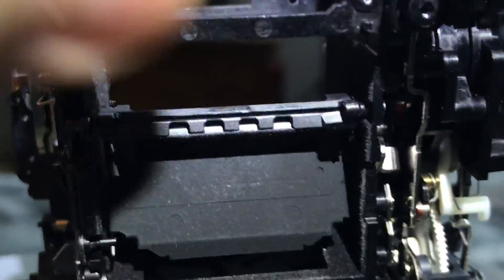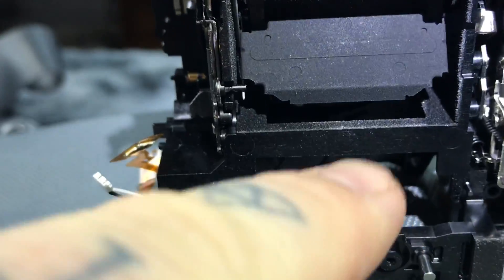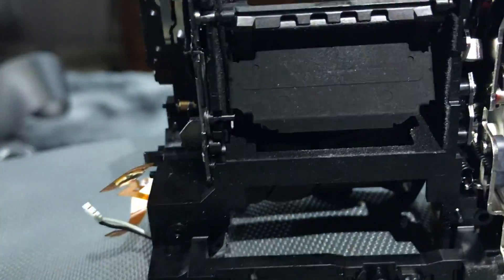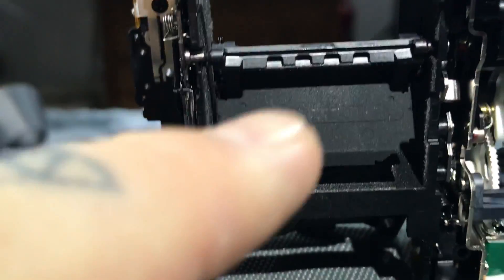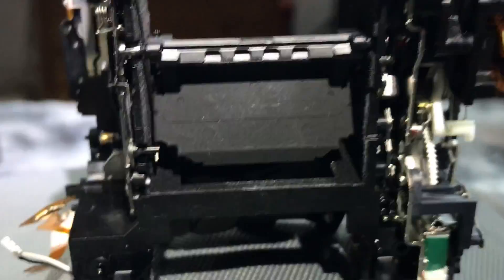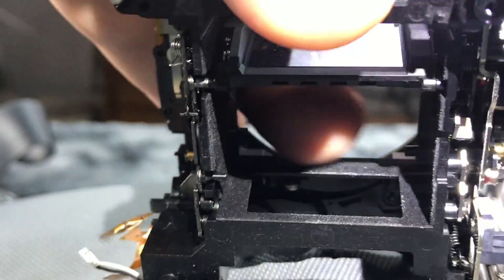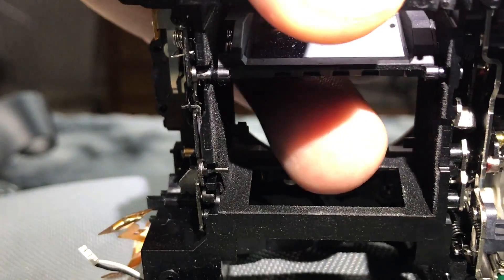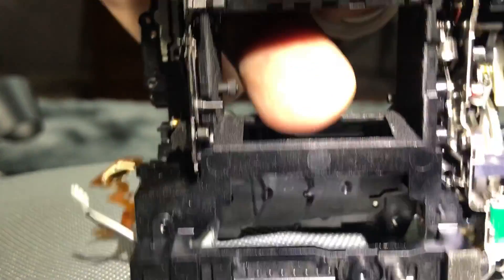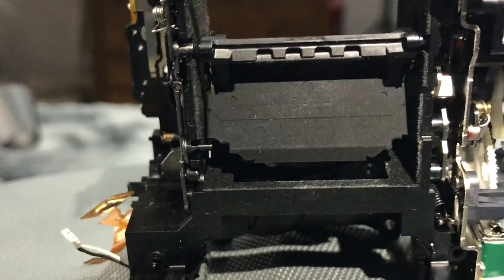This secondary mirror actually drops light at this angle — and I've already removed it. It's the autofocus sensor, which sits right underneath here. I actually sold that since it was good working. This is a Nikon D500, by the way — a modern DSLR, as modern as it gets.